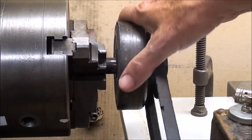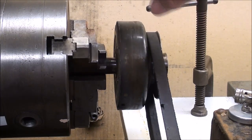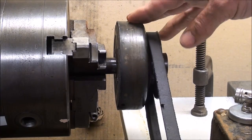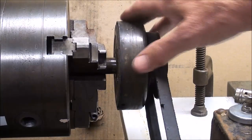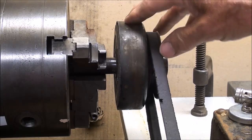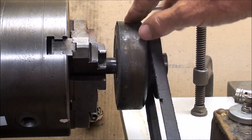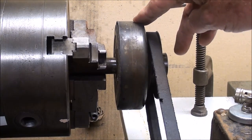But eventually, if there's much slippage, they're going to get very hot. Now if your clutch ever turns blue, then you're running it at the wrong speed, or you're turning your accelerator on and off such that it is constantly engaging and re-engaging, and that'll cause it to heat up. So you need to run them where they're fully engaged, and then the heat will dissipate.